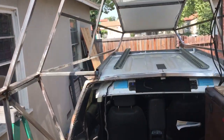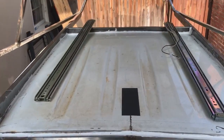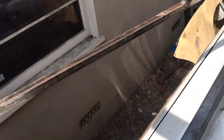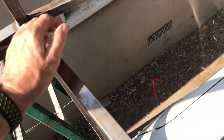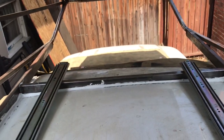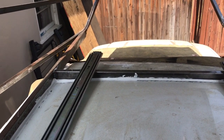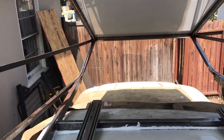Up top I got all of this sealed in — once again the 3M 5200 series, seven days to set up. I'm getting ready to install these rails and then I'll probably work on sheet metaling this area and these triangles next. I think that's the next best evolution, and I'm still trying to figure out if I'm going to need to weld in a crossbar there. For weight I'm trying to leave it out, but for supporting the aluminum I'm probably going to have to weld something in.